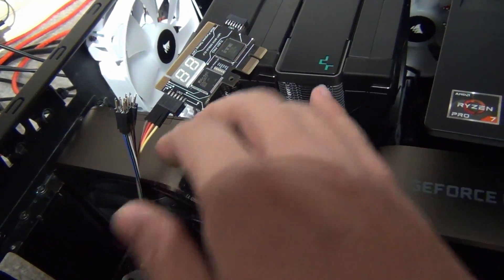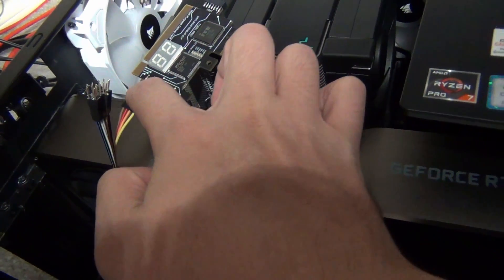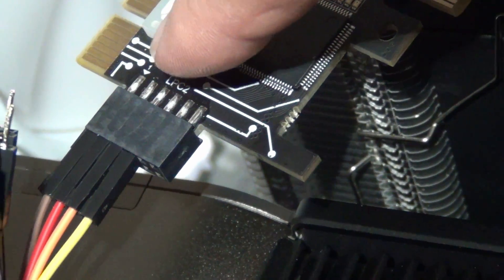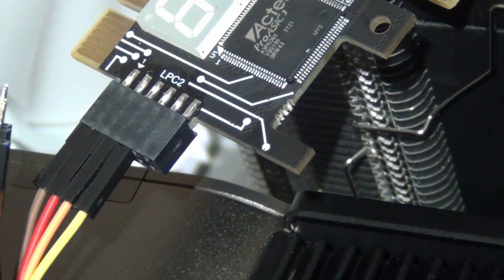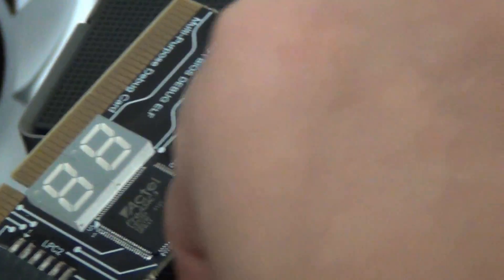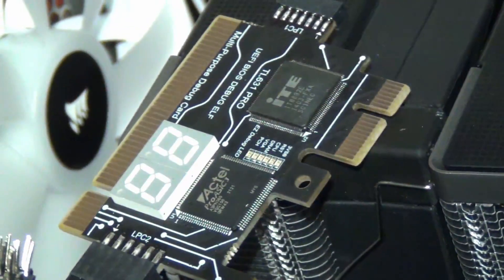In the case of ASRock, it's pretty simple. As long as you have a UART-1 interface, you can map the transmit pin — pin 1, which is the one that looks like it has a ground symbol — right there on the LPC-2 connector. I don't recommend this setup though; it's the most janky-looking thing, essentially resting on the plastic cover of the Deepcool CPU fan, held up by the wires. It could fall onto the metal and that would be bad. Definitely have some kind of insulation if you're doing this kind of setup.